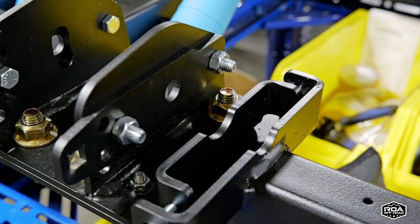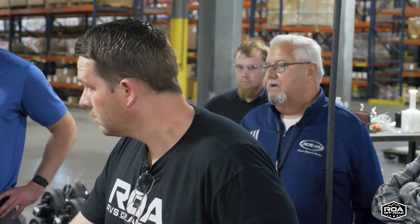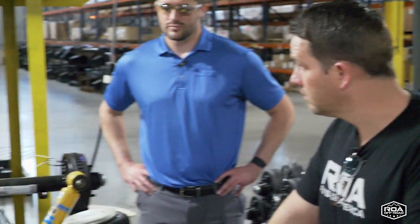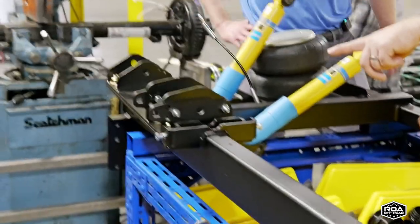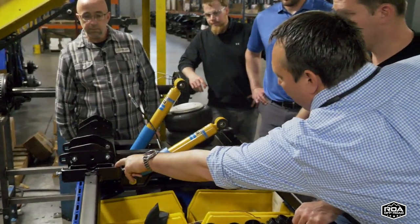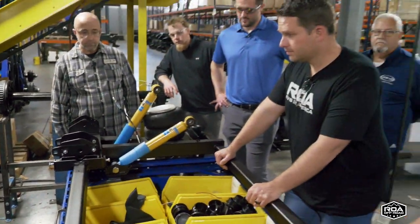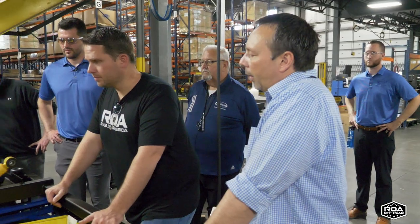So this does have the capability then, based on what you're saying, to go to a semi truck and tire store and actually do an alignment. Yeah, right there, so it's not in a fixed location. The toe and camber is also set up very well. You basically put your ratchet in the end of it, loosen it up, and that's how you adjust your camber. These push pull bolts are there for the toe, but like you say, we basically pin them from the factory. If something like that isn't set correctly, could that make more or less sway? Maybe it can affect sway. It can also affect tire wear, which is where we usually see it.